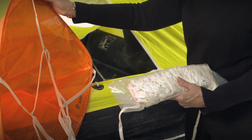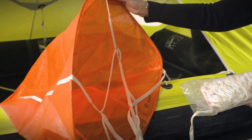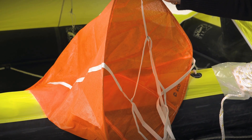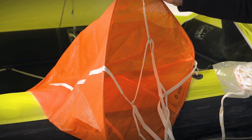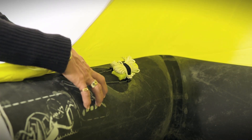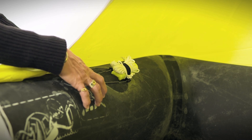The sea anchor is equipped with 100 feet or 30 meters of line and you'll find it on the top of the equipment pack. The sea anchor should be deployed once you are free of any debris or away from the boat should it be on fire. Viking does not automatically deploy their sea anchors, enabling you to paddle away from the boat as quickly as possible. There's a buoyant knife just to the right of the canopy opening to cut yourself away should your boat be on fire or sinking. If the boat is not on fire or sinking, stay tethered to the boat because the bigger you are, the easier you are to find.